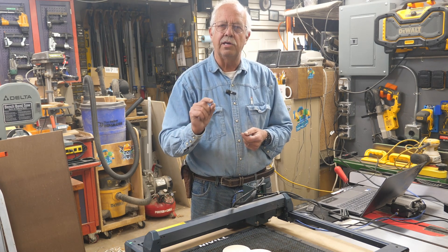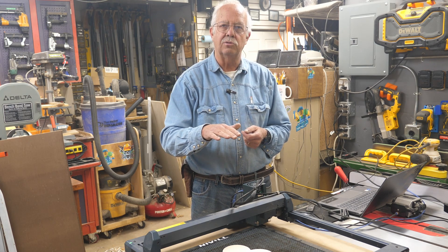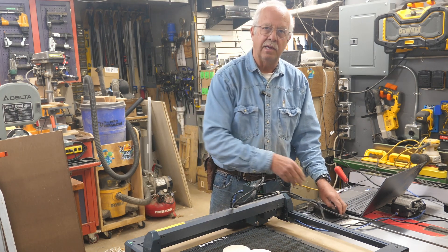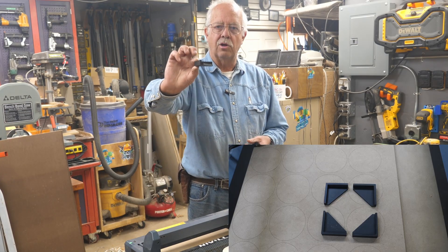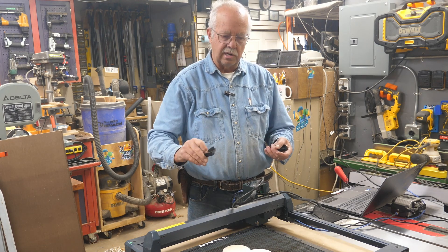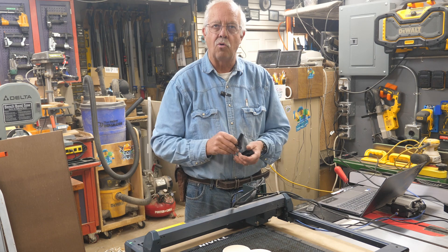If the honeycomb board is relatively clean, all you need to do is space that honeycomb board up a little bit — between the protective sheet that goes underneath and the honeycomb board itself. What I've done here — and yes, this is sponsored by me — I've designed some little 3D printed risers for your honeycomb. They sit one on each corner and raise it up five millimeters. You could also use them on top of the honeycomb board to raise your piece up five millimeters; just remember to adjust your focus accordingly.